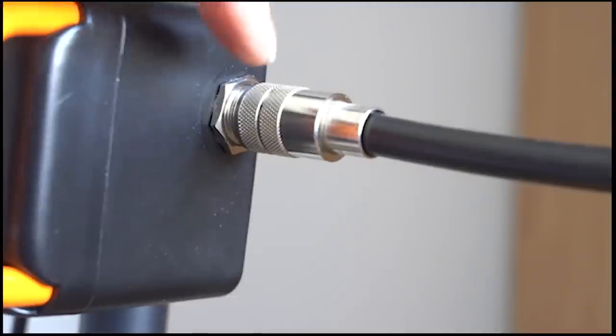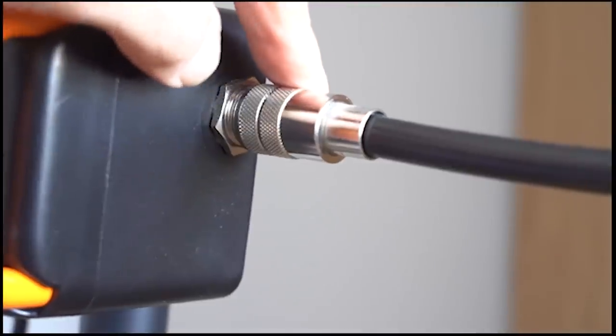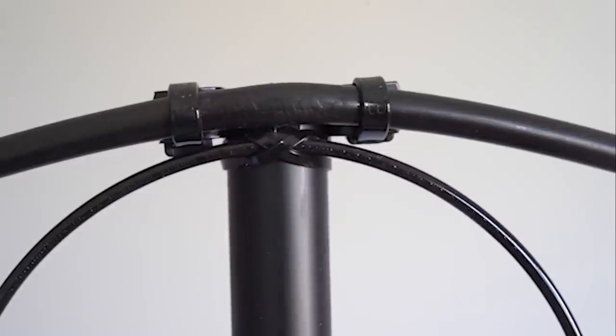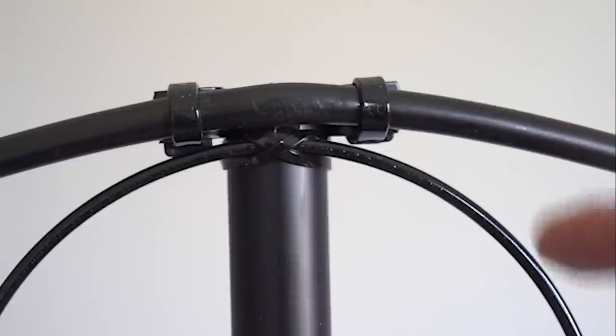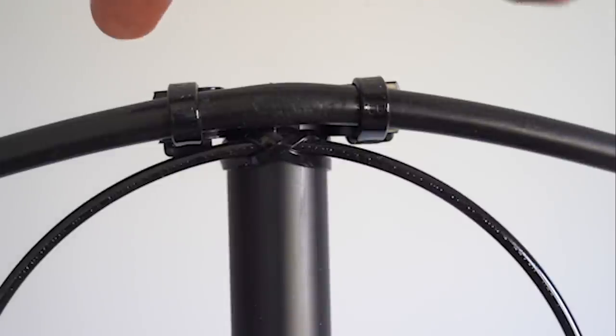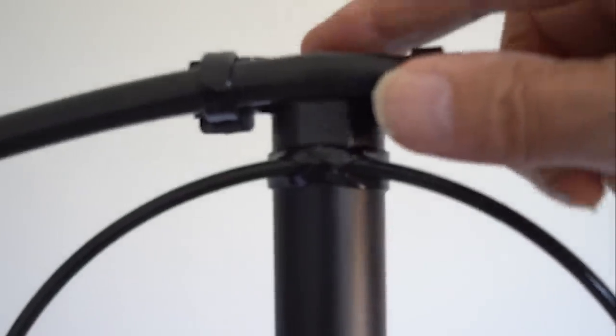The main element is connected to both sides of the tuner using a good-quality PL259 connector. One of the most important parts of a magnetic loop is the coupling, and this is a rigid metal, plastic-coated loop that couples into the coaxial element. The coaxial element is fastened to the top of the center support, and the main element clips firmly onto that center support and is held rigidly in place.